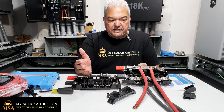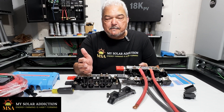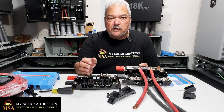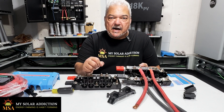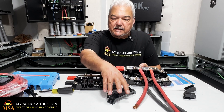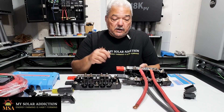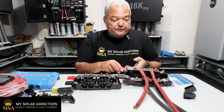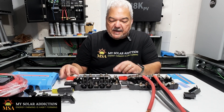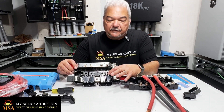The reason is my first run for my LL V2s is already kind of long, so I don't want to have any resistance. I'm going to do double 4/0 out so that I can have a little bit more copper transmitting that energy from that point forward and won't get any voltage drop. Well-built bus bars, just like the distributor — it's basically the same unit but without the connections that would go here for your fuses.